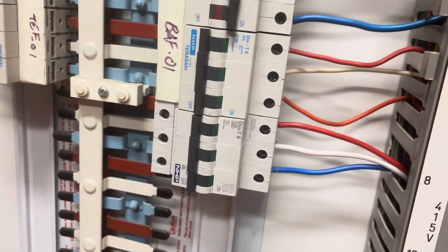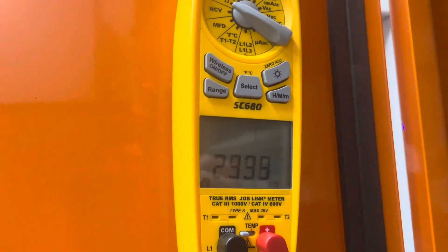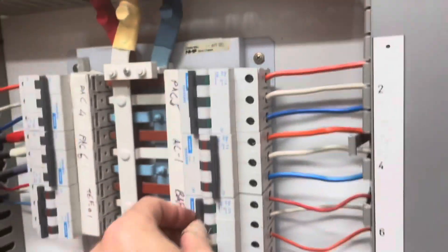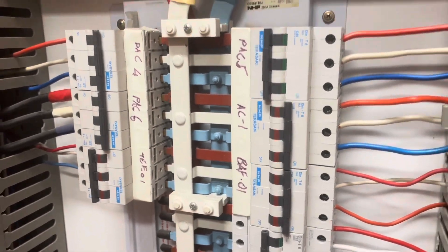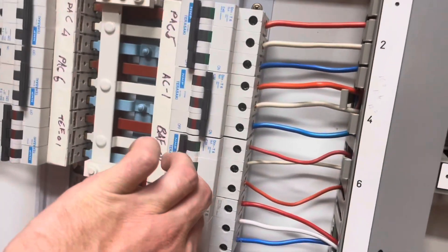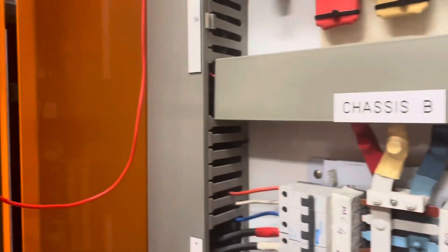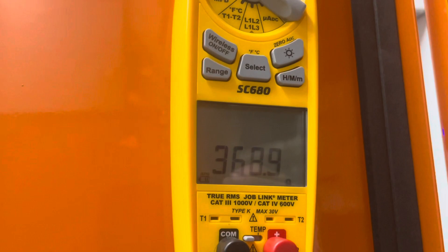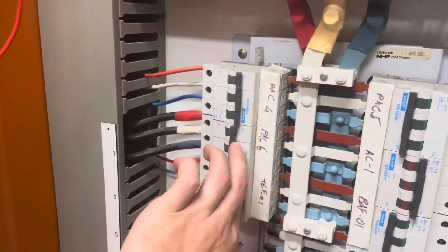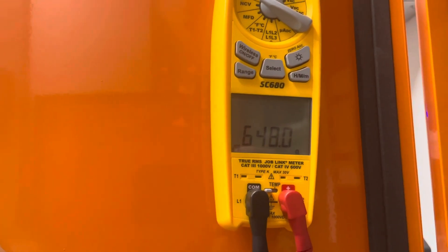If I turn this one on, I've got a reading of 90-something ohms. We flip that off. AC2 — I'm getting a reading of 2K ohms. This big-ass fan is giving me a reading of 10K ohms. This AC is giving me a reading of nothing, so that's on. This package unit — if I turn that on — is 360 ohms. This package unit is also 360 ohms, and Pack 4 is 640 ohms.